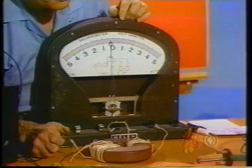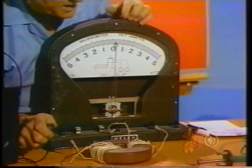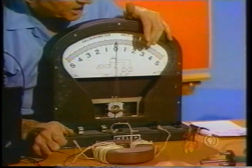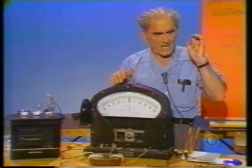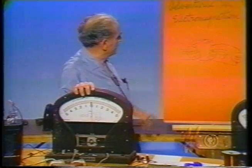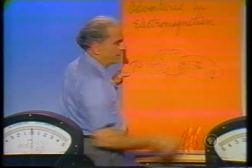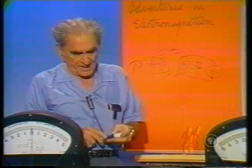On the make, we have a deflection in one direction. When the circuit is kept closed, the current is steady. But it is a change of current which gives rise to a changing magnetic field, which gives rise to induction felt by the other coil. The coil I energize we usually call the primary, and the other is the secondary. But I could turn them around and interchange their names.